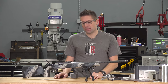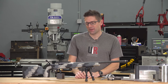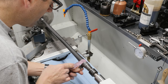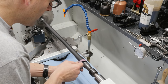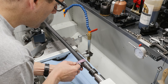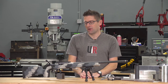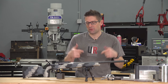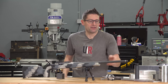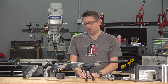Overall, there were some really interesting things to learn, especially on the muzzle end. I also chucked it up in the lathe and did a polish on both ends since I don't yet have a barrel spinner — a really nice way to do it. I made a threaded cap, chucked that up on the headstock side, ran a live center on the tailstock side, spun it in place, did a little polish on the shank, and double-checked and polished the ring I cut on the muzzle end.